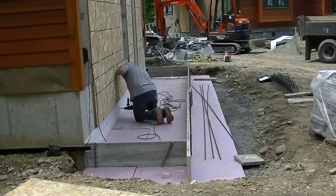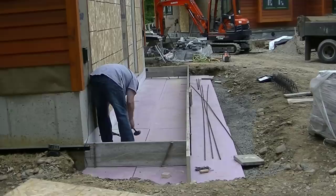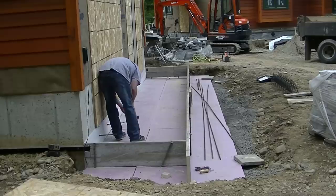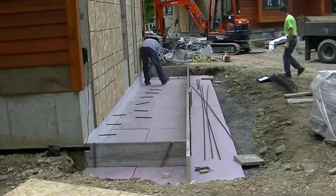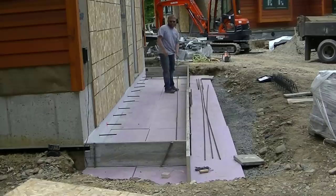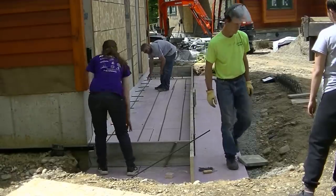The homeowner wanted us to drill and pin into the existing slab, just to make sure this thing never moves up higher than the concrete floor in the garage. So we drilled every two feet and put in these twelve-inch pieces of number four rebar — nothing crazy, we're not using dowels. We basically just want to keep the pad from lifting or settling, and then we're going to tie a number four rebar right in there with it.